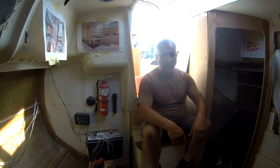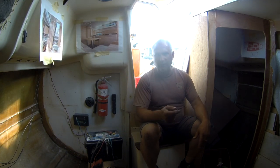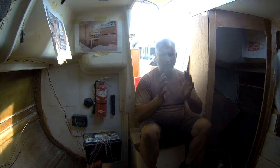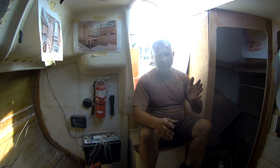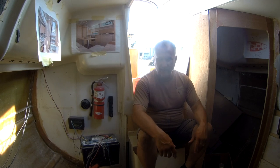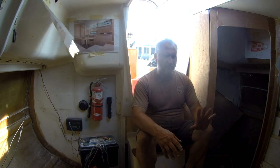Last year I fixed that side before I put it in because I found the grinder mark, so I filled it with epoxy and fiberglass and that was all solid. Then I checked the other side and it was just a hairline crack. Once I ground into it I could see it was wet. I'm guessing that when I repaired one side it held it, then when I put it away in winter on the cradle, the weight is different — the boat is sitting on the keel. So there was compression weight, and I'm guessing it cracked over time with the winter and all the grinding, sanding, and ripping out I was doing. I re-fiberglassed all that and it's all good now — bone dry.